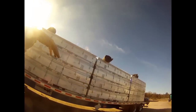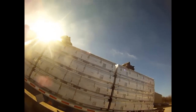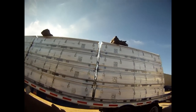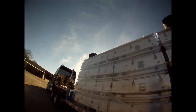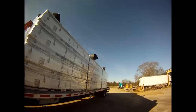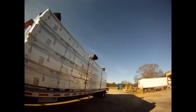You lay it out with your overlap and then your next one on top, so that the wind rolls right over the top and doesn't get underneath. It's pretty squared away — not going to be a real long video, not too many gaps, just things you've got to deal with. Everything lined up just barely to get three straps. Per the rule, the aggregate for working load limits is not a problem with two, but I prefer three — that gives me one about every three feet or so, and that's mostly to help pin down my tarps since I'm going over the top of them. Easy to walk on, no problems.